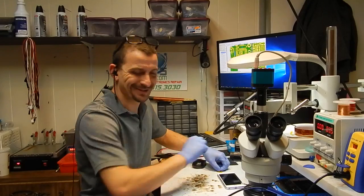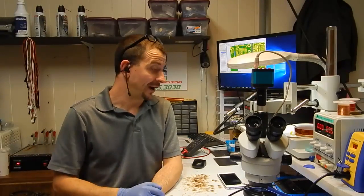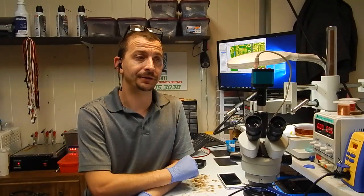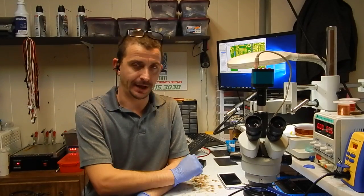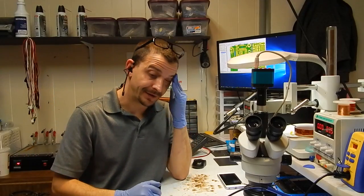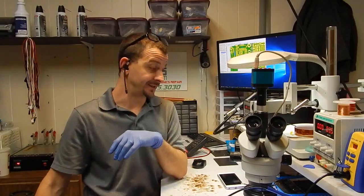So anyways, that's going to be it for this video. I hope you all have successful repairs. I hope you learned something from this. This is a pretty good way to rig the backlight on this phone. These people will most likely never know the difference in having both circuits alive or half the circuit alive. It's not going to make a difference on brightness that I can tell. I've held the two side by side.